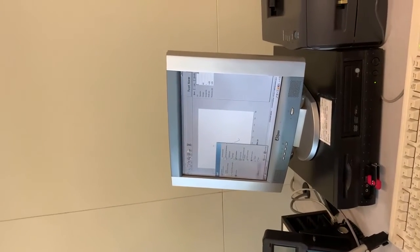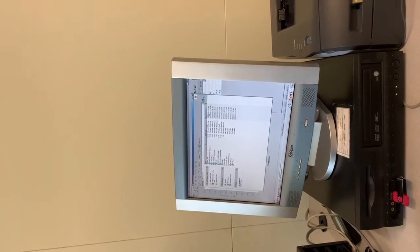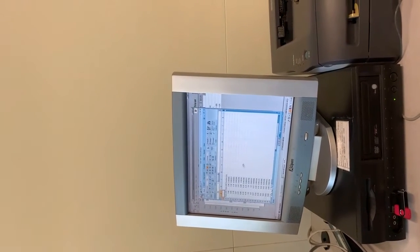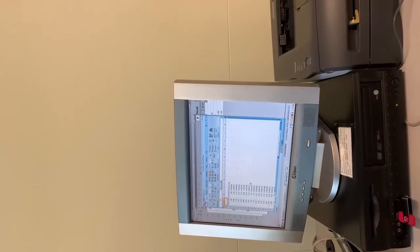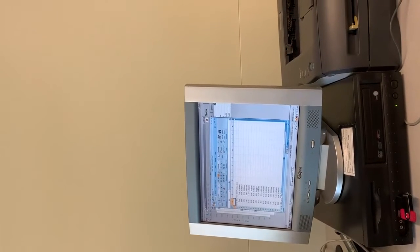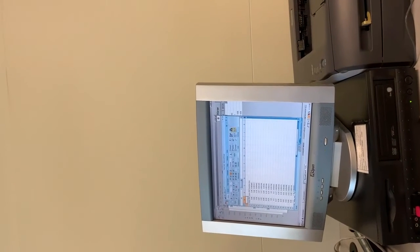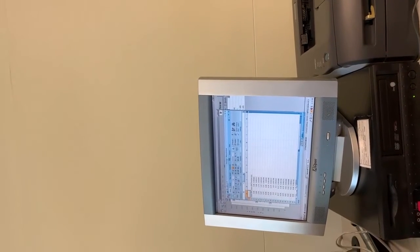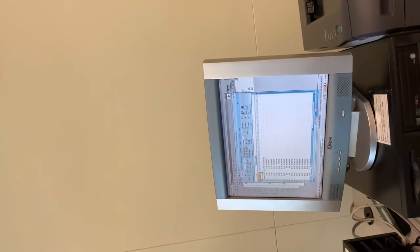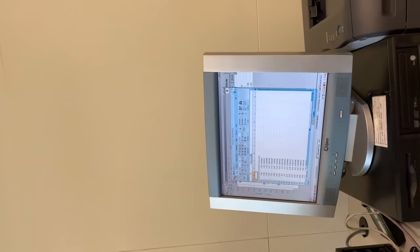And so if you go to Start, My Documents, and I believe it's called the Tech Test 781133. So that is our test. And if I open it up, you see it has force and position. Again, position is a change in length. So all you're going to do now is use the force, change that to stress, use the position or the change in length, and change that into strain, and then you can plot stress versus strain. You want to make sure you save this test as a different test, with another name, right? Because the next test you're going to run is also going to be saved under the same name. So you always want to make sure you save your test with a different name.